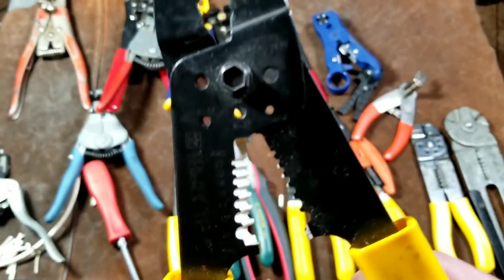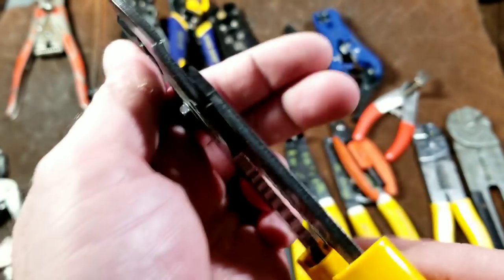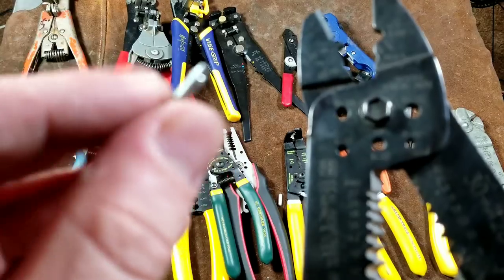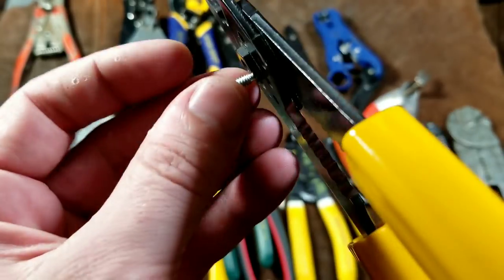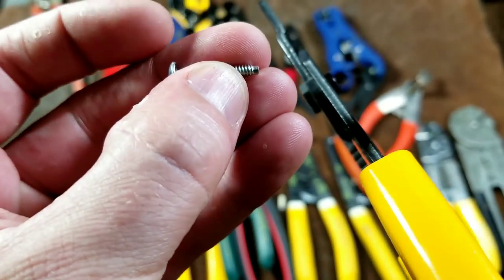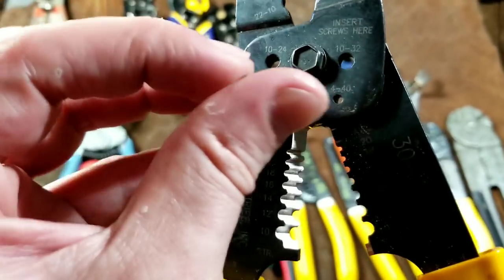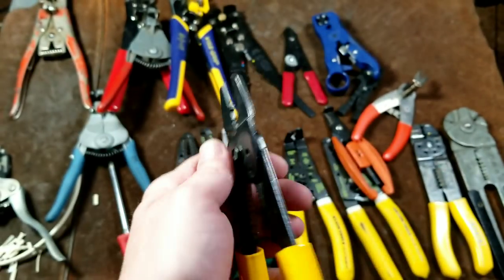And the one big tip, the one big mistake people make, is that one side of this panel is threaded, the other side just has a pass-through hole. So of course you would line them up. It's pretty obvious. Usually it's the printed side that is the threaded side. You always put the screw into the threaded side. If you run it through the non-threaded hole and then thread it in, what happens is you cut the fastener, but then you leave some flats on the ends of the threads that you actually want to use to screw in somewhere, and then it doesn't screw in smoothly. You always have to screw it in through the front here, screw it through the front like so, and then when you cut the fastener,